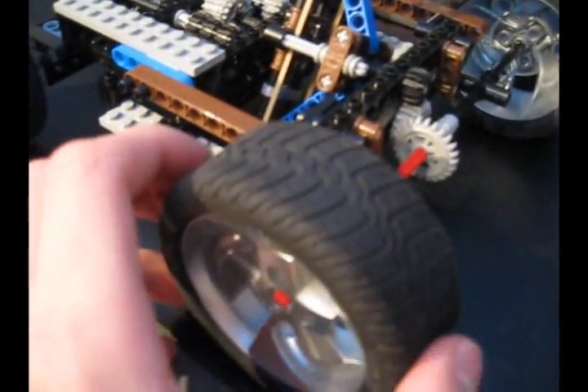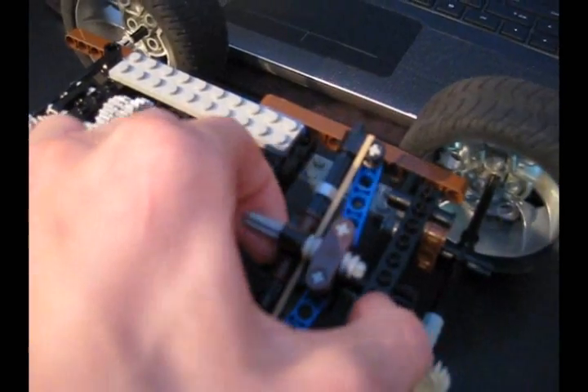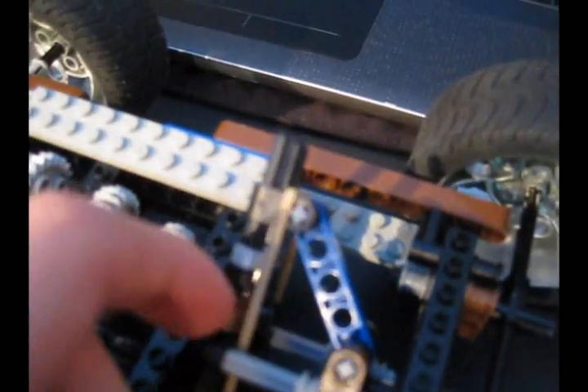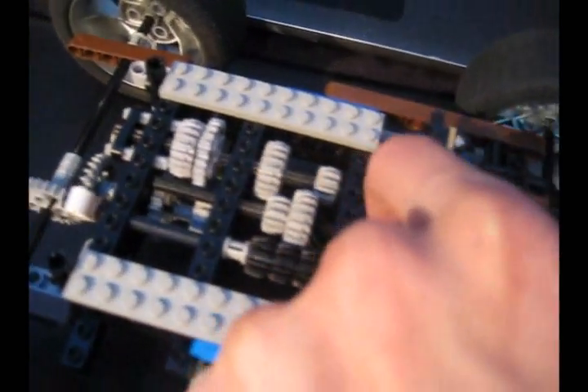The spinning wheel is geared to the two front wheels, so that when these wheels reach high enough RPMs, it will spin this wheel extremely fast. The way that it achieves its motion and shifts the gears is that the centripetal force required to hold these in place — you can see those things move outward — so the centripetal force to hold it towards the middle will be greater than the force of the rubber band, and that will cause these things to spin outward. And that motion will pull the gears forward, like that.